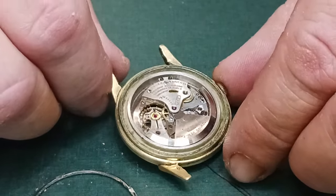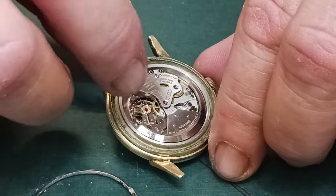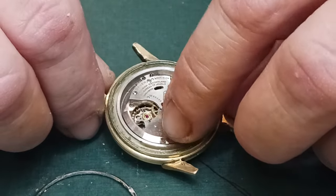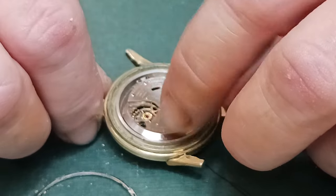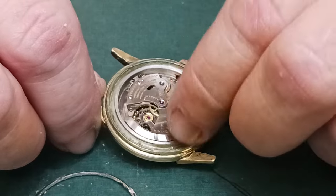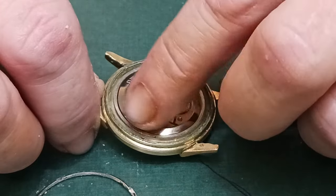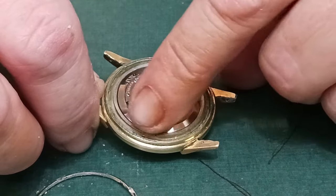It's very pretty, but people aren't familiar with what a bumper watch is. Okay, so you have a fully automatic watch. What this one is what they turned into. But you have a spring here that catches that weight. That weight unscrews from this. This comes back around and hits that other spring. And it does a half turn, and that's what winds the watch. Just like an automatic that would spin 360 nowadays, this one only went half.